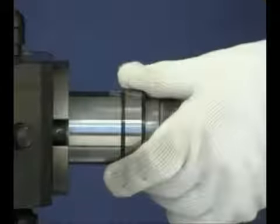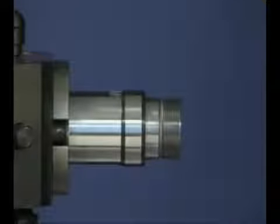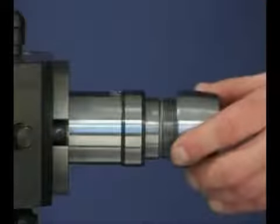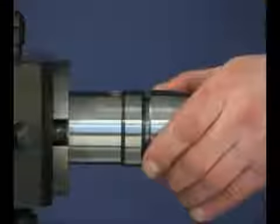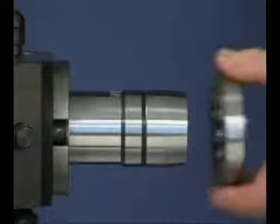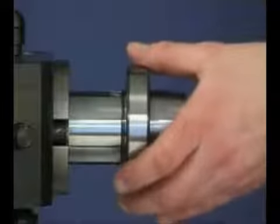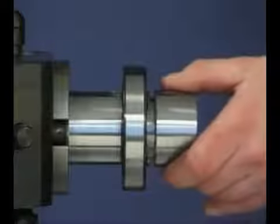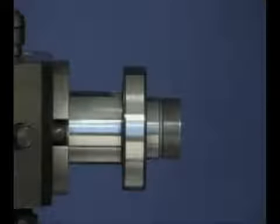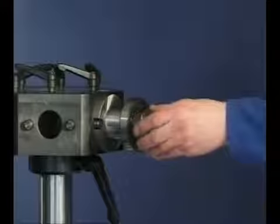The second part of the process of mounting the bearing is fitting the outer ring assembly onto the shaft. To prevent fitting damage to the inner ring, a guide sleeve is used to position the rollers during the process. Oscillation or rotation of the outer ring will assist the fitting process, as will the use of oil. This is normally a sliding fit and is easily accomplished. After removing the guide sleeve, the bearing is secured onto the shaft by means of a lock nut.